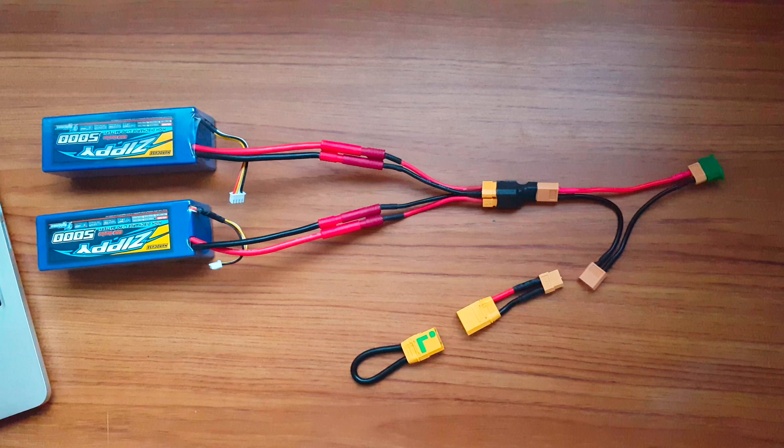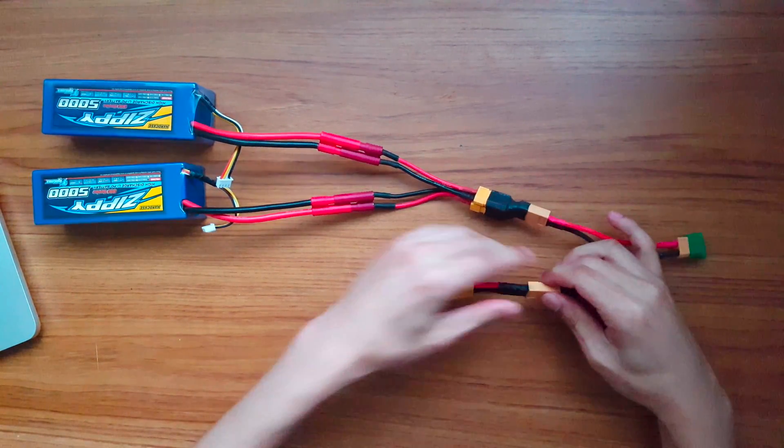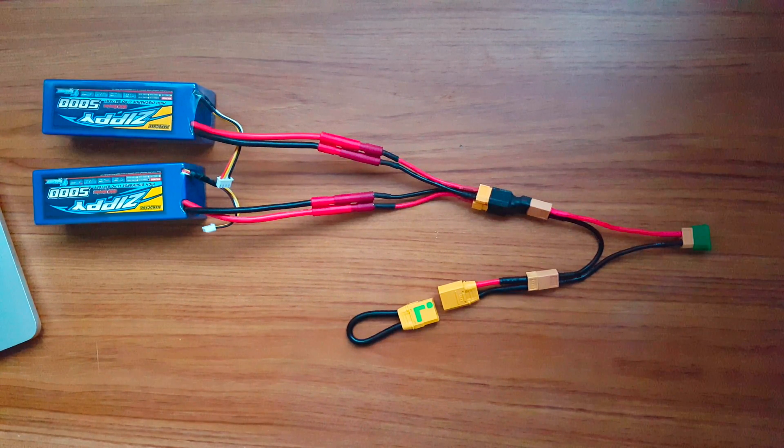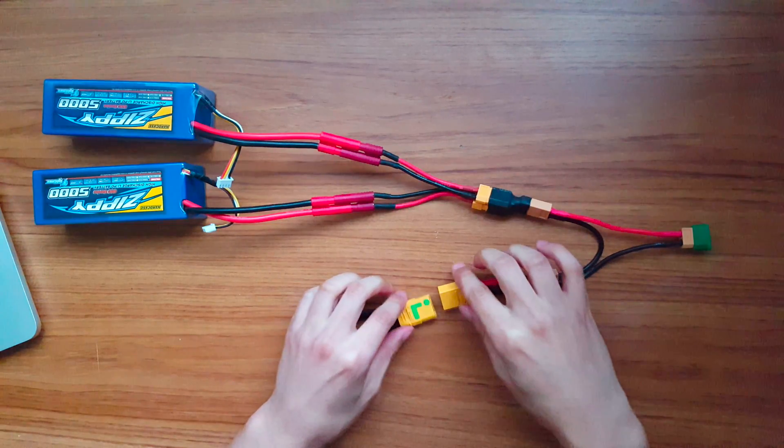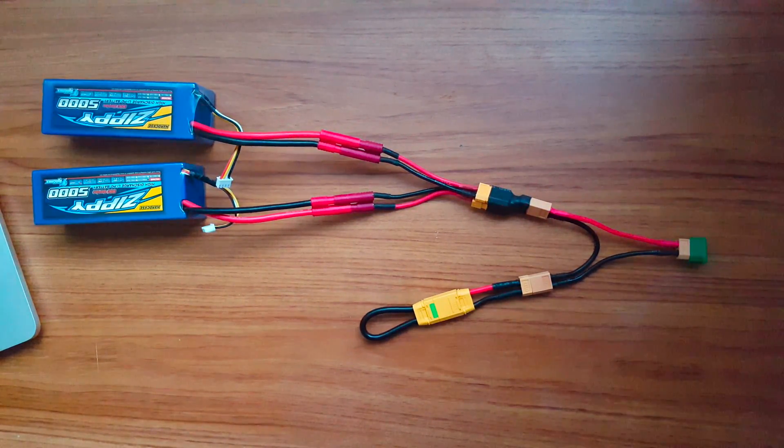Because of the ambiguity of this connection, it has two black wires. Now for the electric skateboard, this connector is actually used for the anti-spark, which takes advantage of the latter two options. So because it's an XT90 anti-spark connector, I also need this female XT60 to male XT90 adapter. And finally, the shorted female XT90 anti-spark connector to complete the loop.